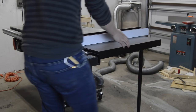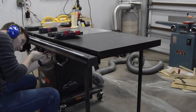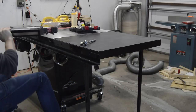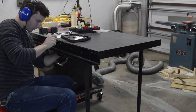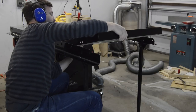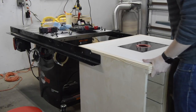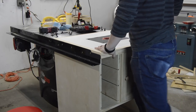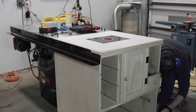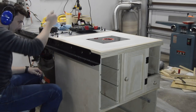With the cabinet construction completed, I can remove the temporary extension wing from my saw and slide the cabinet into place. I had planned to drill some holes and bolt the cabinet into the saw, but I ended up just sliding it into place and using the adjustable feet to level all four corners of the top flush to the table saw surface. Since I never move the saw, this has been working fine. I worry that if I had bolted it in and tried to lift the saw onto its mobile base, I might bend the rails or damage the saw because the cabinet is really heavy. If I ever need to move the saw, I can just slide the cabinet out and then move the saw.